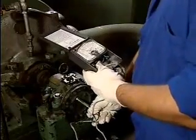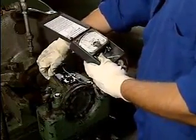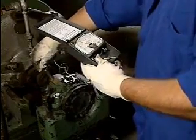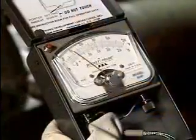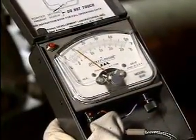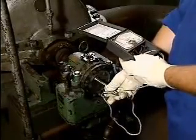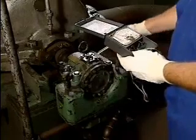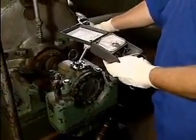Overheating is another symptom that can be felt. Typical points for overheating are the bearings and the stuffing box. Excessive heat in either of these locations usually indicates a problem with lubrication. It's good practice to use a temperature measuring instrument, such as a pyrometer, to check for overheating. It's possible to check for overheating by placing a hand on the stuffing box or the bearing housing, but do this with great caution. You could get a nasty burn.